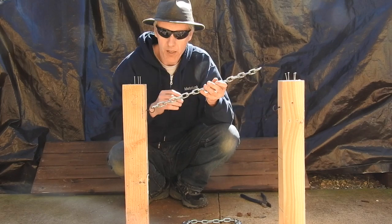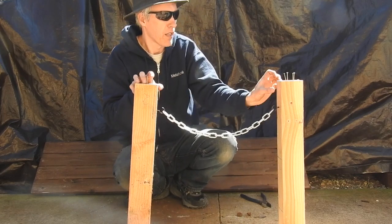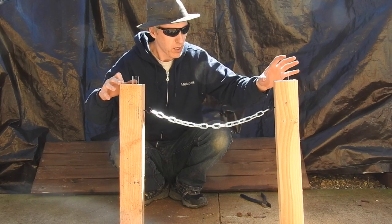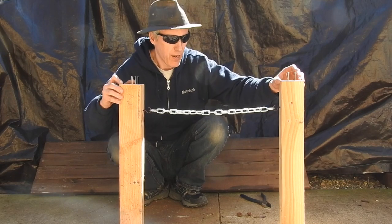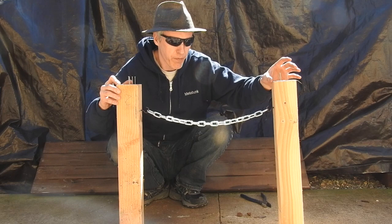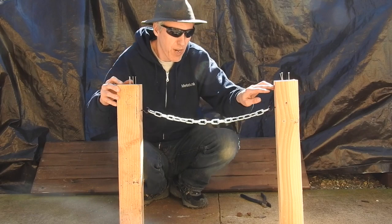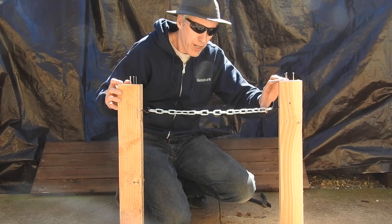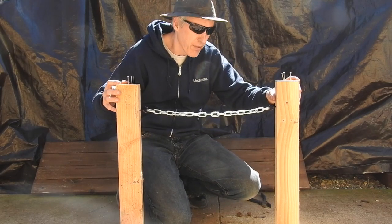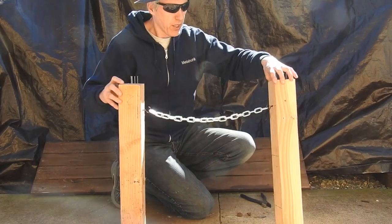Let me take this floor off and replace it with a failed floor. Straight away you can see that it is pulling in. If I pull it so it's perfectly straight, as soon as it starts to sag a little bit, it's pulling in. The reason is that when you have something suspended between two points, you have this catenary action, which means when it's straight, pretty much all of the force is going sideways if the member is not stiff. Whereas with the stiff floor, it's just fine.